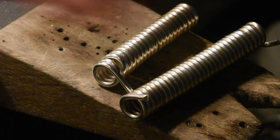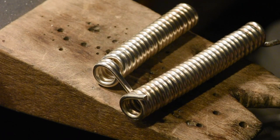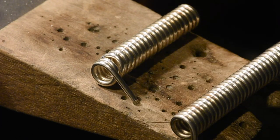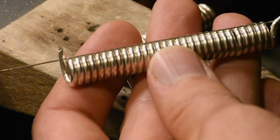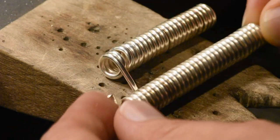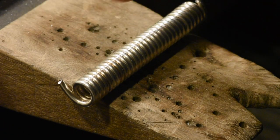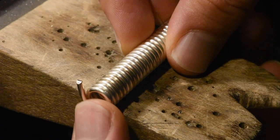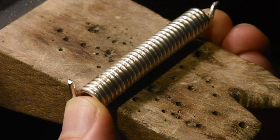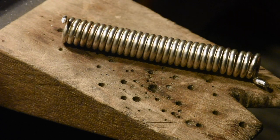Now that I've got some coils, I could go ahead and cut them with some snips, but then I'm gonna have these little compressed areas that I'll have to file down. So what I'm gonna do is use the saw. They do have these jigs that people set up to cut all of them at the same time, but I don't do this frequently enough to spend money on that. I mean, I could carve a channel in a piece of wood — take a block, carve out a channel with a router, slip this in, bolt it down from the bottom with a hook, and just go in from the top. That's for another day.